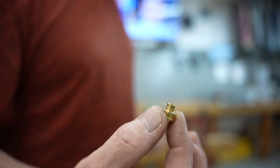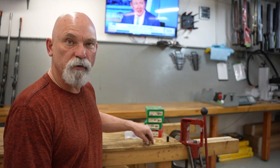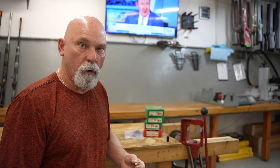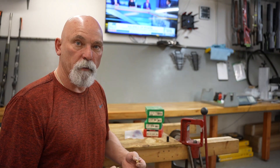What causes that is the decapping rod that he's using to knock these out. I asked him what he's using, and he's using a universal — it's an RCBS universal decapping rod. Apparently the universal decapping rod won't work very well, or won't work at all, on the primer modules.